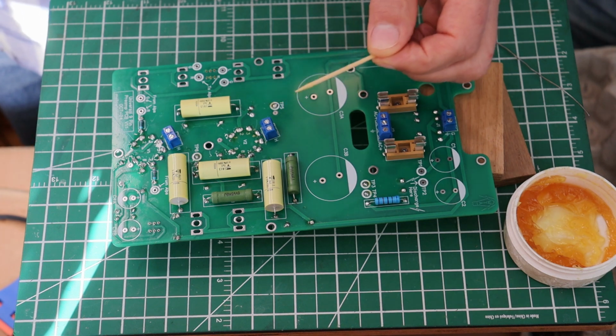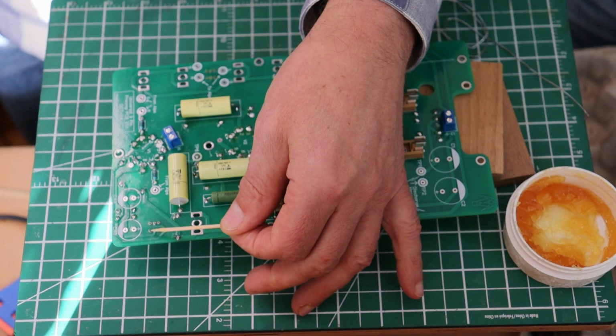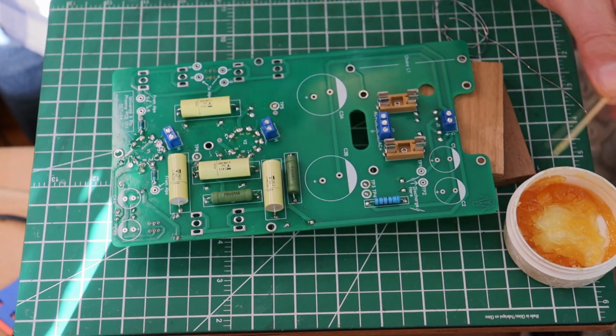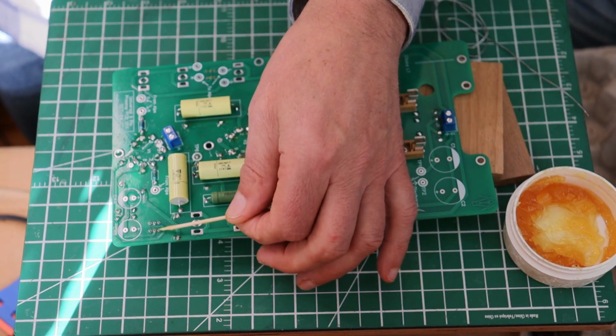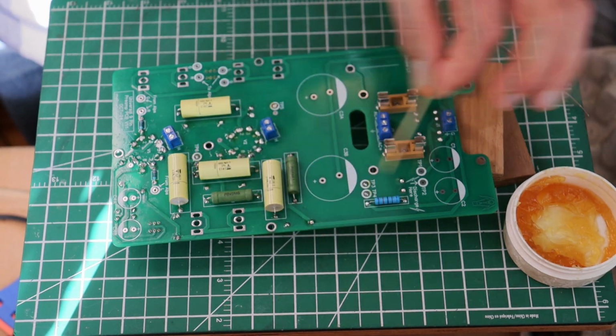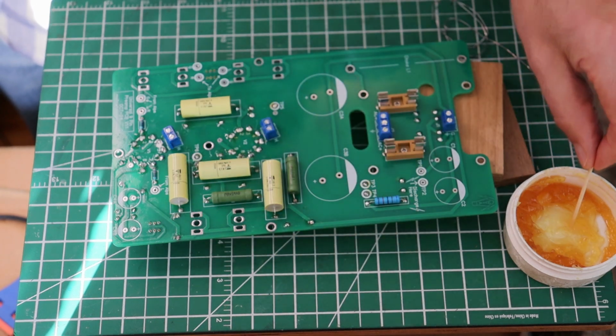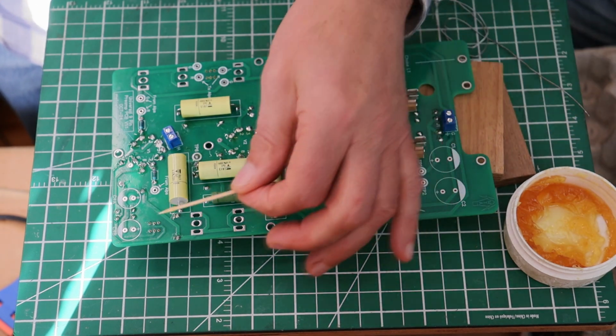We're going to keep using the standard one that we always use, and it is a bit big, but we're experienced enough to be able to use it. Yeah, this would definitely be a time to put a smaller tip. Now, if your smaller tip's brand new and you haven't used it, go find some junk parts and do some soldering. Yeah, because break it in first.